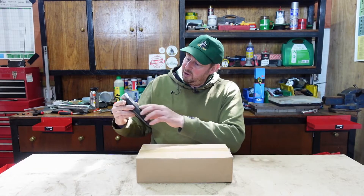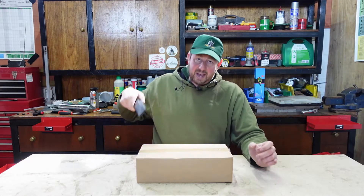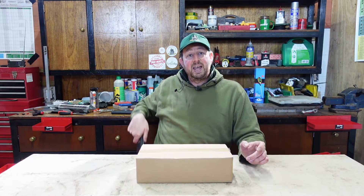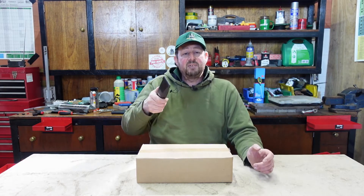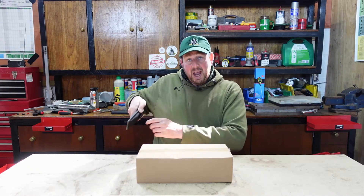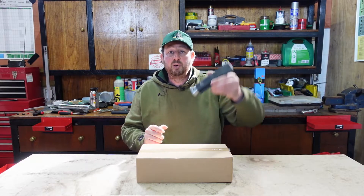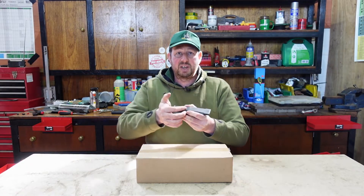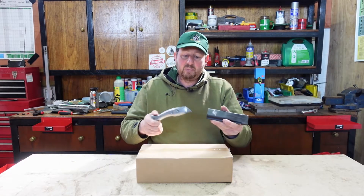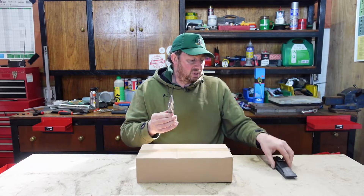It's called a Dolphin knife — it's got a little dolphin on the case, so you know it's an original one. It's got a little hook on there. When you've got carpet fitting or floor-laying trousers on, you've got a little pocket at the side to put the knife in and it slides in quite neatly. If you haven't got those trousers, it will fit onto any sort of pocket and grip quite tightly. The good thing about this case is you can turn it upside down and the knife doesn't fall out — it clicks in with a positive click. The reason it has to fit like that is because there's a fixed blade with no way of retracting it, so it's got to be safe in this plastic holder at all times.